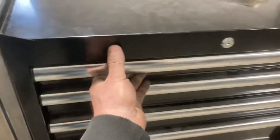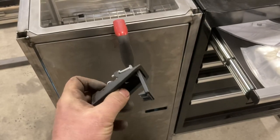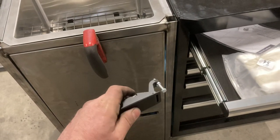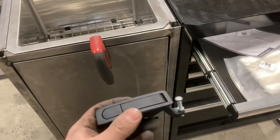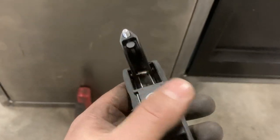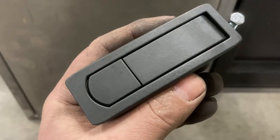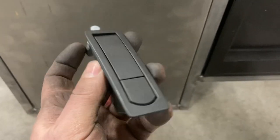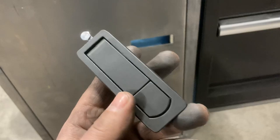I just got done building this door. I have this latch — I like these a lot. It's just a release button, and when you lock it this piece comes around the back, swings totally out of the way, and grips the back side of the frame. It's adjustable for tension and you can make them clamp down pretty tight. It just takes a rectangular hole and has a U-shaped piece that bolts to the back. Southco is the company that makes these — you can find them online. I think this was about $25. Kind of expensive, but super clean. The other cabinets in my trailer use basically the same style latch, so I wanted this to match.